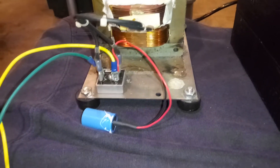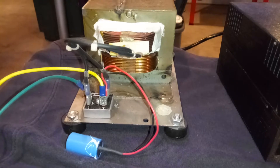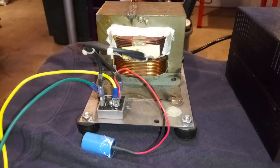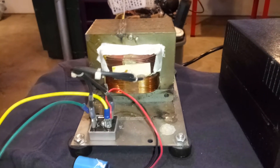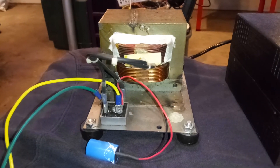If you can't do that for some reason, you could always do the transformer-rectifier method. The reason they suggest using a transformer is basically for isolation. You could always run power direct out of the wall into a rectifier, but 9 out of 10 people you ask are going to suggest against it — there needs to be some kind of isolation.